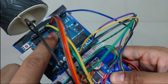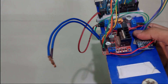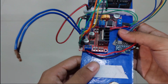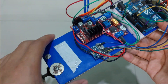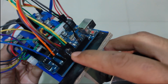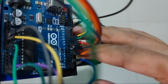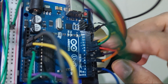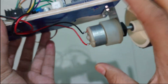I recommend roughly plugging these in and tilting the car a bit to check what it's doing. You'll need to calibrate the sensor too — we'll get to that in the code section. You can easily flip the polarity later. The four direction signal pins go to pins 5, 6, 7, and 8, and pins 9 and 10 are your PWM speed pins.